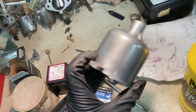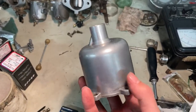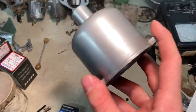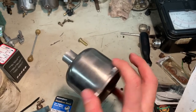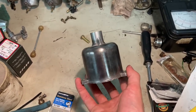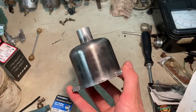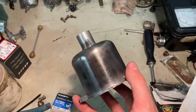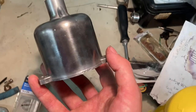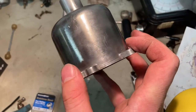It might not be necessary, but these are going to be on top in prominent view so I want them to look a little nicer. Here is the before — after using the mag cleaner and polish with steel wool — and over here is the one I used a soft bristle wire wheel on. As you can see it's much shinier, almost mirror-like. Make sure you're using a soft wire wheel; I started with one too stiff and you can see I have some scratches I need to take care of.